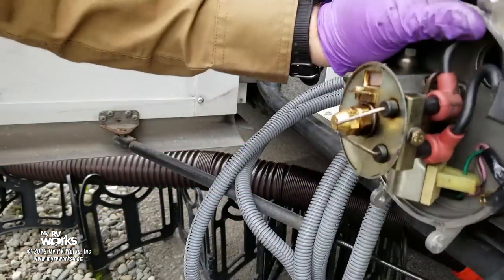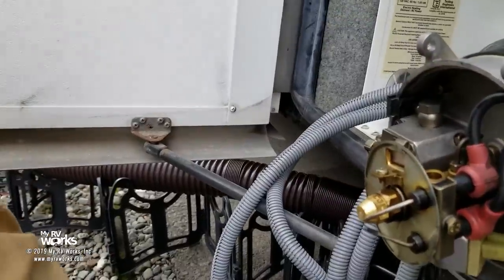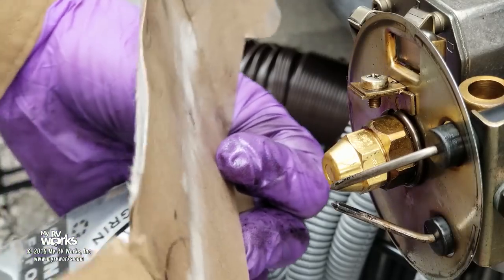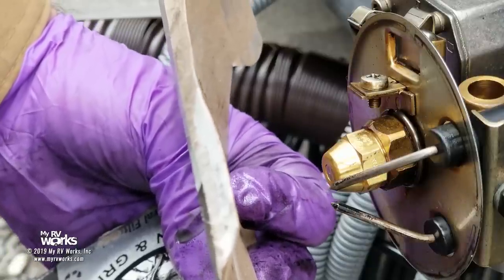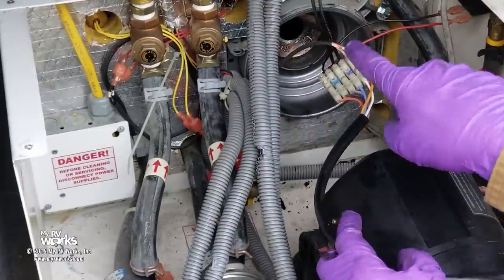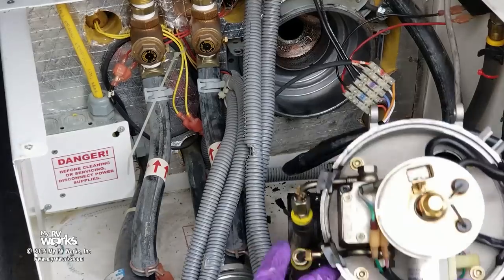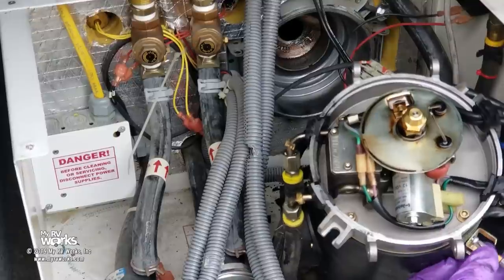My finger's on the off switch. Look at that fine mist — did you see that? So we've cleaned our burner, we've replaced our nozzle using the tighten-loosen-tighten method. Let's adjust our electrodes — they look fine, but since we've come this far let's do one more test to make sure the electrodes are properly set.